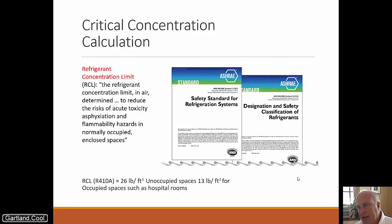One of the things that ASHRAE does is that they actually take any refrigerant that's being commercialized and they do a number of studies on them — they provide them numbers. If a product has an ASHRAE number such as R12, R22, R404A — they're all the way up to like 454, 455 right now. In order to get that number you have to provide certain things, and one of those things is a safety check to find out if it's safe and what classification it has.